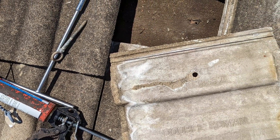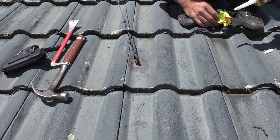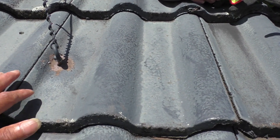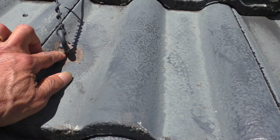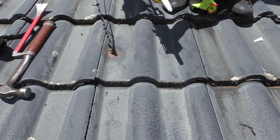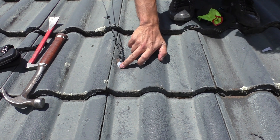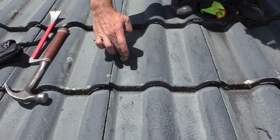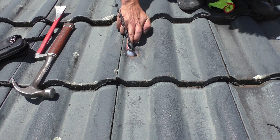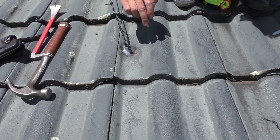You'll have water that runs around the anchor, through the tile and into your ceiling. Now if you do have a leak, what you need to do is take the old sealant out. You'll find it's fairly easy to do because the installers wouldn't have put a lot of sealant around the anchor. You've got to take all the sealant out and apply fresh sealant. The important thing is you've got to push the sealant through the gap around the anchor as far as possible so that the hole has got silicon all the way around.